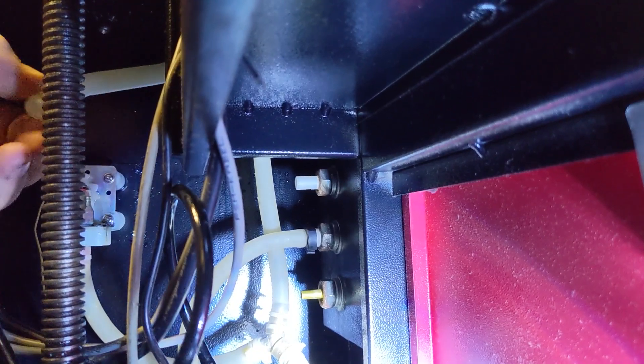This will protect you from having the same kind of disaster we had in our shop today. It shut down my whole production process for the whole day — I wasn't able to get any work done at all, including filming a new video. About this quirk with Chinese CO2 lasers: do not trust the zip ties. Just hop on Amazon, buy a pack of these little hose clamps, and call it a day. You should order a pack to have as extras, plus a full set for all the hoses in your CO2 laser, because it could save you a lot of headache.